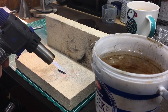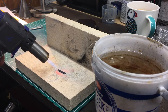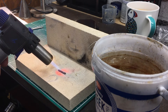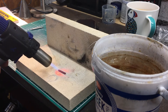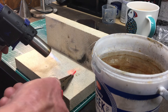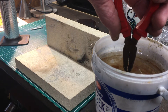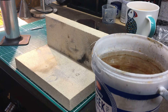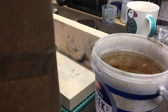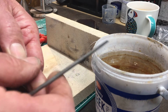Here's how I normally do it — it's very straightforward. This is a bit of silver steel, eight millimetre diameter. It's been heated to cherry red, which equates to about 780–800 degrees C. Hold it for a little while and then quench it into cold water. There we are — the blank is hard, the file won't touch it.